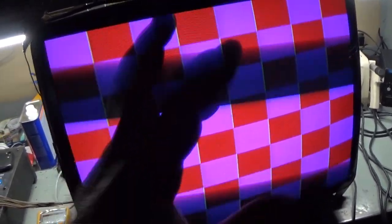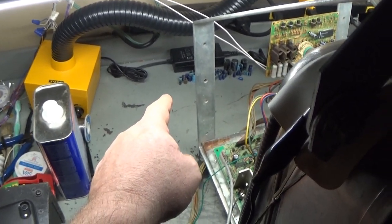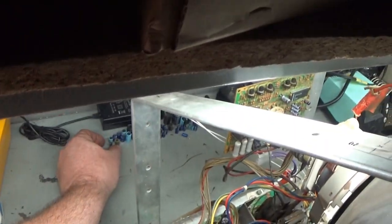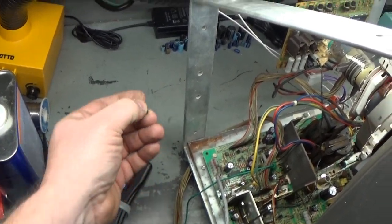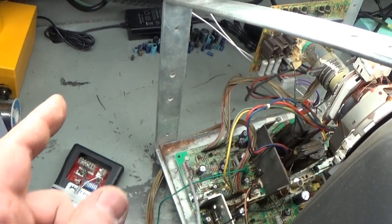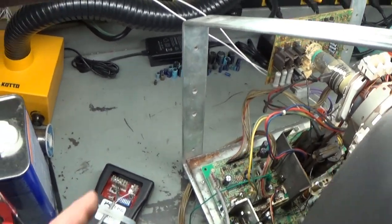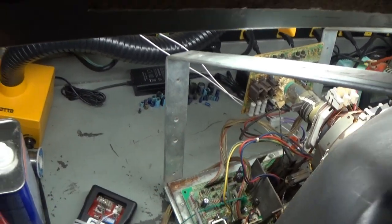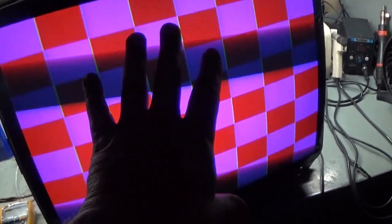So I'm absolutely confident now that that 63 volt 33 cap here was the problem on that, because this was original and not replaced. So we changed out the full cap kit. I can't say with 100% certainty that was the cap, but being that was the only one that wasn't replaced, I'm fairly confident that was probably the problem. But we got all the caps changed out. So it looks like our linearity problem was caused by a cap issue, which I was absolutely confident about.